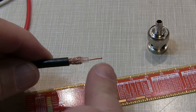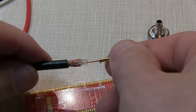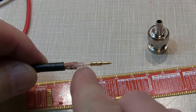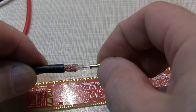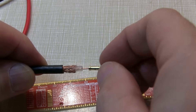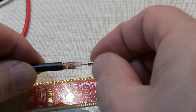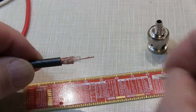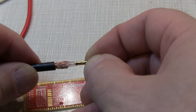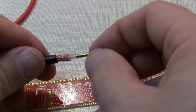The next thing we want to do is trim the length of the center conductor, and we can use the connector pieces as our guide again. If we stick the center conductor pin on here, we can see how much length I need to trim away so that when this thing is fully seated, the bottom of the pin hits the center insulator. It looks like I need to take about 3 millimeters off — a little more than an eighth of an inch. It looks like I need to take just a little bit more off. Okay, so it looks like we've got that length right now.